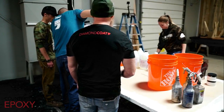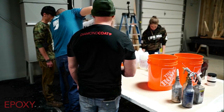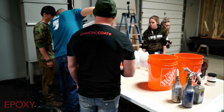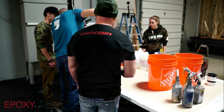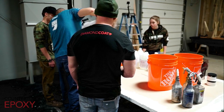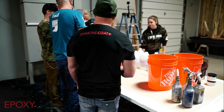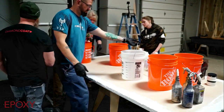Anyway, you're going to be spraying out more color, and so as your bottle is getting lower and lower, you just want to be adding more powder, adding more alcohol, and getting your solution just right. Obviously, you can spray a couple more times if you want it more concentrated, but if you just add a little bit more powder, it's going to work out overall. You don't want to wash out your pattern by having too much alcohol and not enough powder. So that's a pro tip.